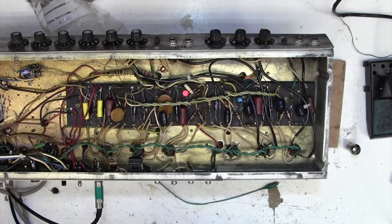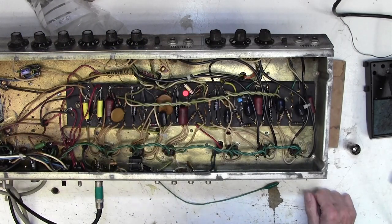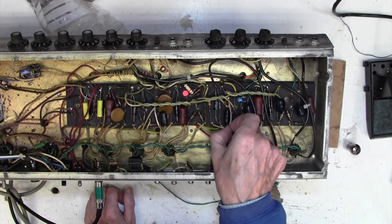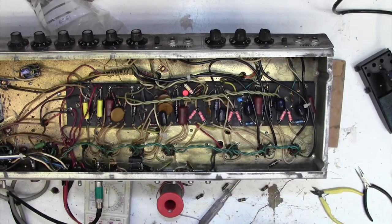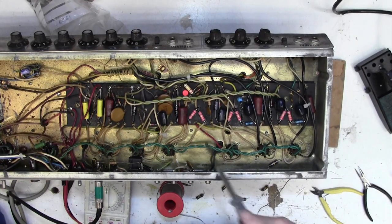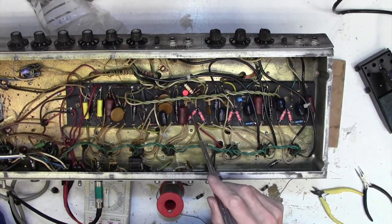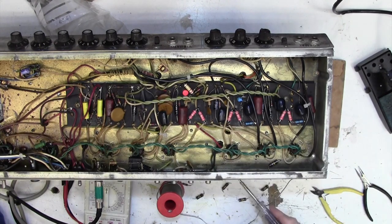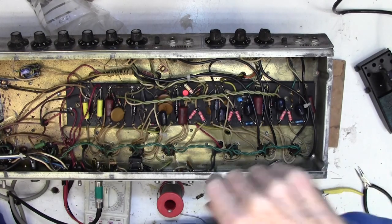So I'm going to turn the amp off and discharge it, and then we'll swap those resistors out. Okay, I thought whilst I was at it, I'd replace all of these 100k resistors. So I've done those two, that one, and that one. Moment of truth, I'll turn it on. I haven't turned it on yet.